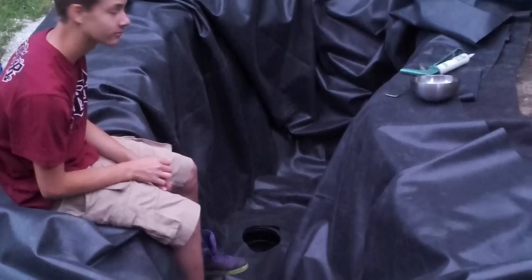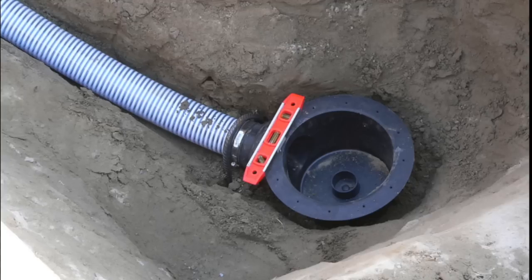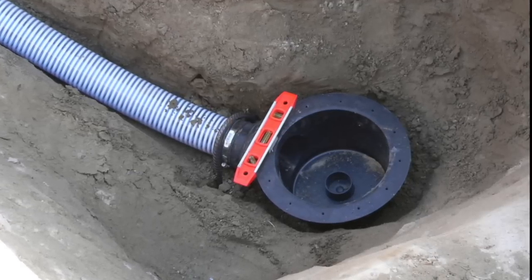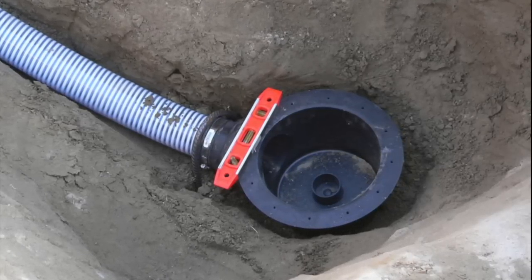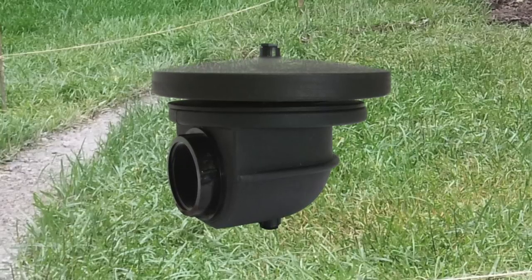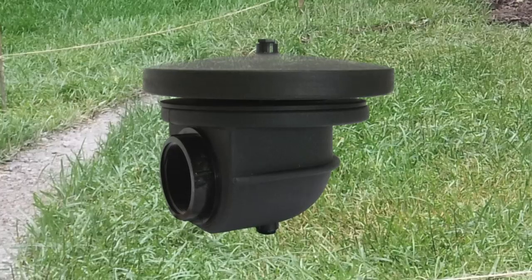In the center there, you'll see I've already dug a hole because I have put the drain in already. I had dug down four feet from my pond and then an additional foot to put this drain in. The drain then goes with the pipe up into my filter barrels. Here's a look at my drain in profile. You can see that gap at the top there — that is where the water will then go through and then out to my filter barrels.